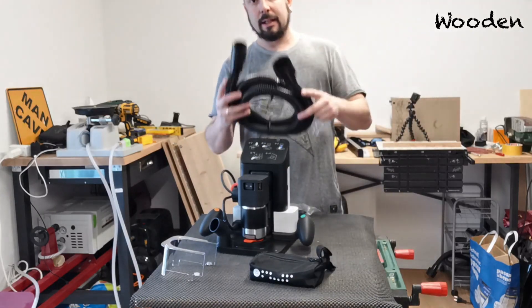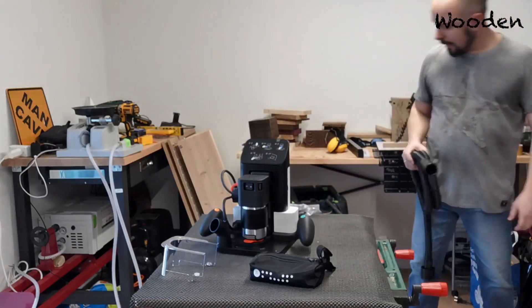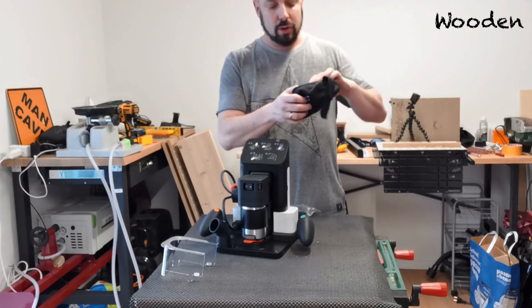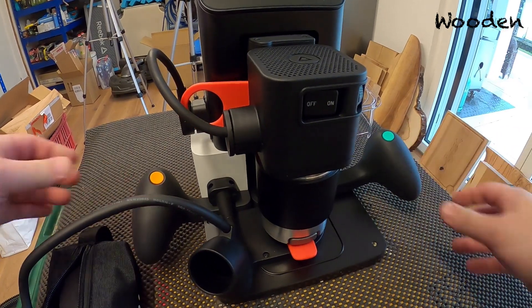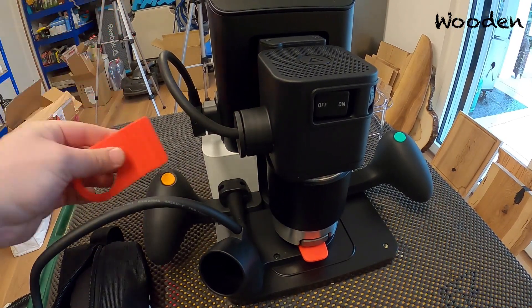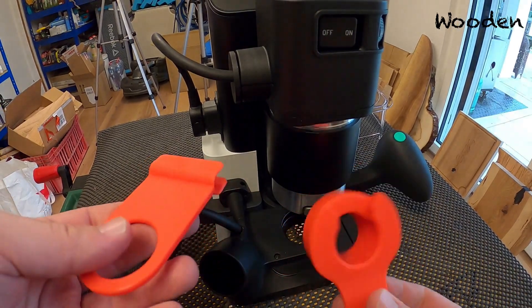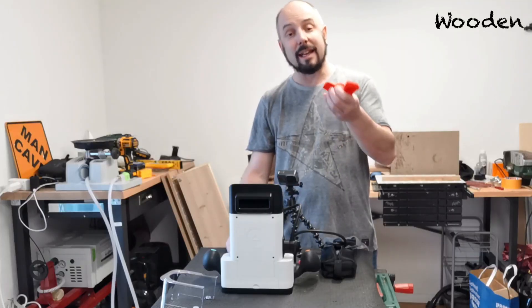We have this little pipe here — a tube that you attach to your vacuum cleaner. I'll say more about this afterwards. Then you have this little bag here that contains all the useful gear you need to get started with your Shaper. To get started, first you need to remove the two security elements for transporting the Shaper. There's this little thingy here and another one down there. You move your spindle up and then you can remove them. I'd recommend storing these away in the box in case you need to transport it.